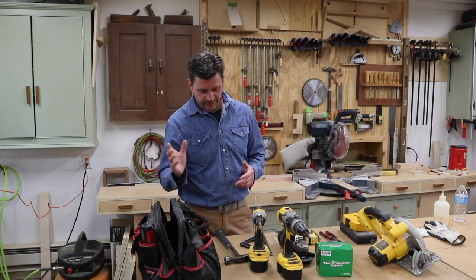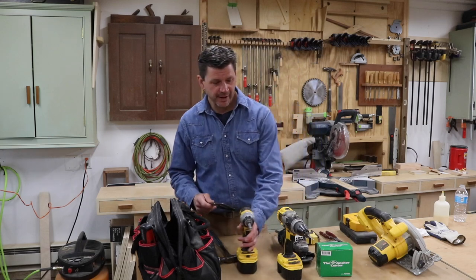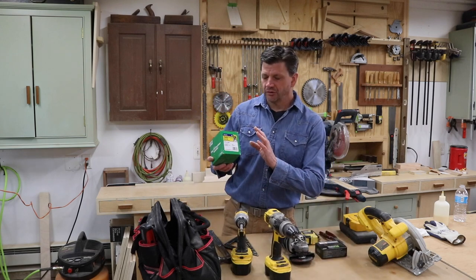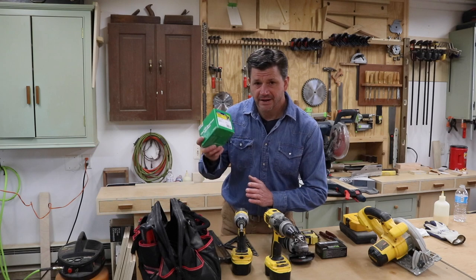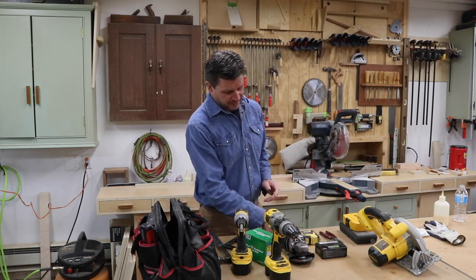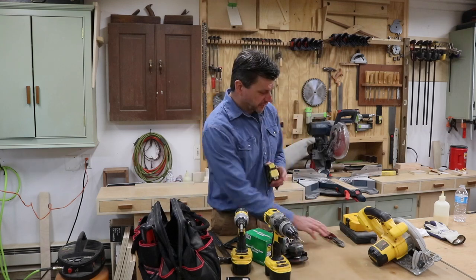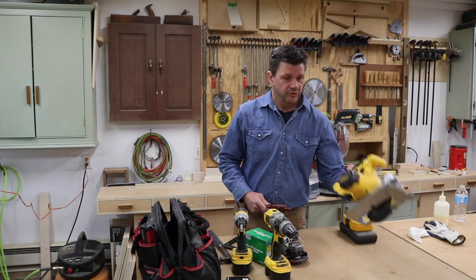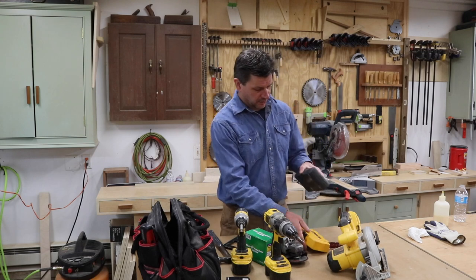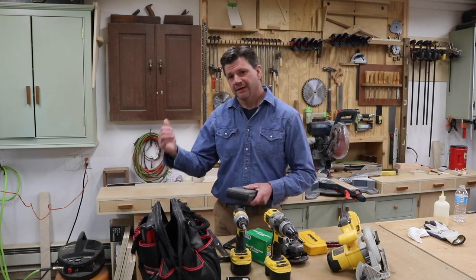So here's a few of the tools I'm gonna need. I always bring a hammer, speed square, impact driver, drill. Because it's masonry, I'm going to have masonry drill bits and Tapcon screws for attaching the 2x4s to the cinder block. This is a little overkill, but I'm gonna bring a grinder with me, you never know. Tape measure, nail cutter, circular saw, couple of drill bits, and a couple of screw tips. So I'm gonna put everything in the bag and we'll hit the road.